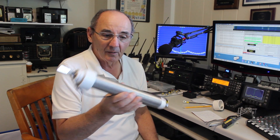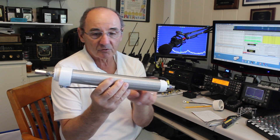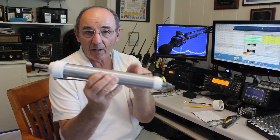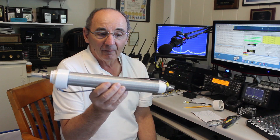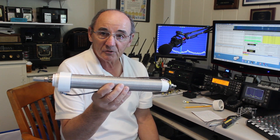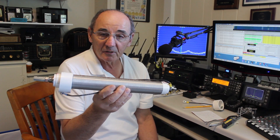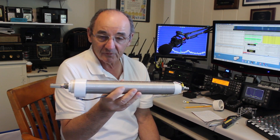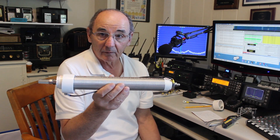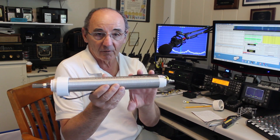Another question is what's the difference between the Silver Bullet 1000 and the Platinum? Well, they both look exactly the same. The only difference is the core material that this wire is wrapped around. This is the Silver Bullet 1000 — it's lower power: 100 watts SSB, 50 watts CW, 20 watts digital. With the Silver Bullet Platinum, it's 500 watts SSB, 300 watts CW, and 100 watts digital. That's really the difference.